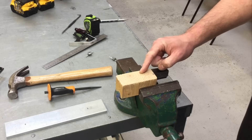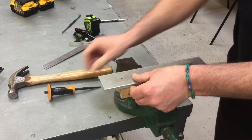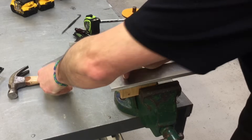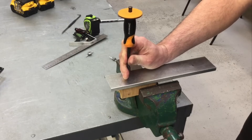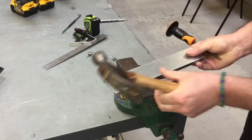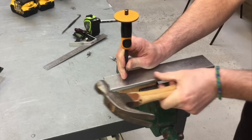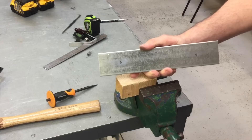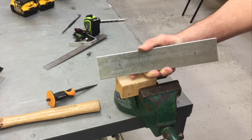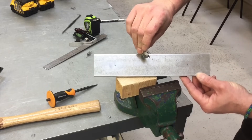I position the block of wood in the vice to make dot punching easier. We've got our two marks and we're very careful to get the dot punch in the center of the cross. I take my dot punch, find exactly the center, and give it just one dink to mark the position for the first hole. Likewise on the other end — just one dink. We're not trying to make a hole with the dot punch, we're just marking the start position. I'll now drill probably 3mm, followed by 6mm, followed by 10mm to fit the turnbuckle clips.